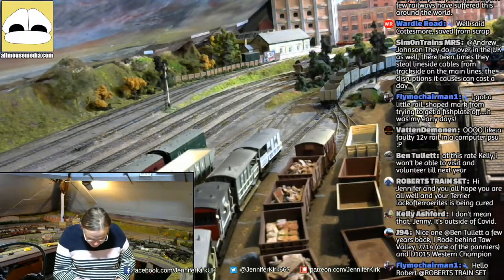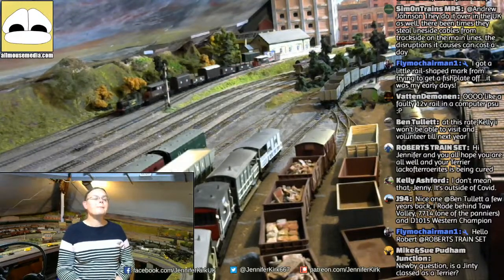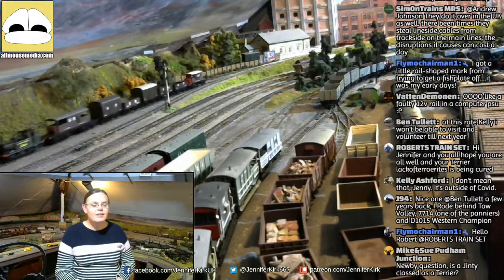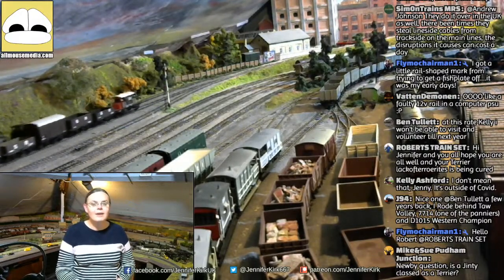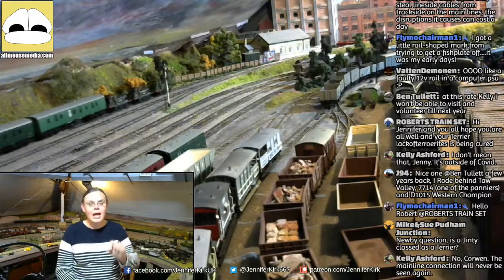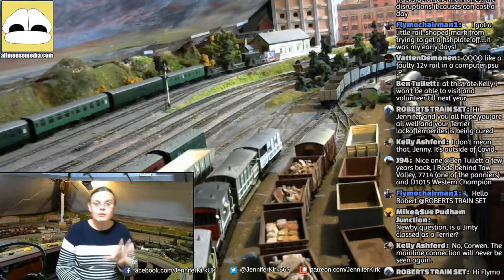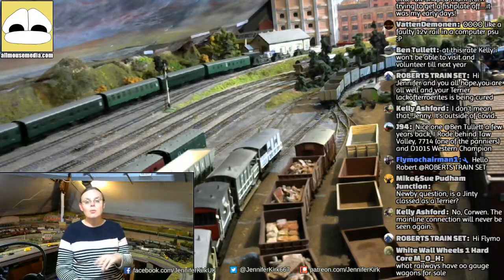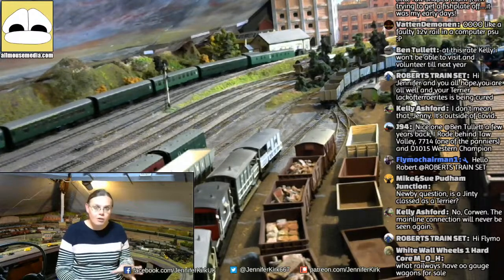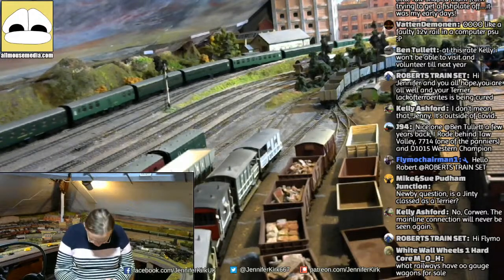Brian Sims says, Hi Jen, was looking for a TTS sound chip, but all my trains are 6-pin. How do I change from 6 to 8 so I can fit sound? You can hardwire them, that is possible. I'm trying to think. I think DCC Concepts may sell an 8-pin to 6-pin adapter. They certainly sell an adapter that allows you to plug a 6-pin decoder into an 8-pin socket. So it may be worth checking with DCC Concepts if they have one that goes the other way. Failing that, it is possible to hardwire, but obviously you need to be quite confident with your soldering ability on that.